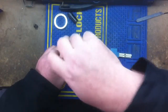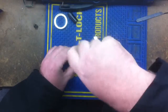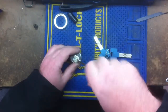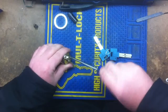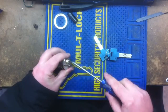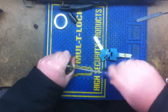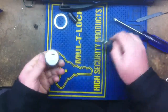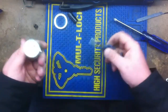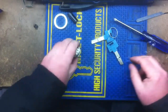The tailpiece will go on upside down, so make sure you have it properly attached in the correct direction. Put on your tailpiece and your screw on your tailpiece. Back-thread it a little bit — there we go. Now you have a Mul-T-Lock Interactive from the box, rekeyed to the correct key and ready for installation on the door.